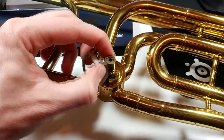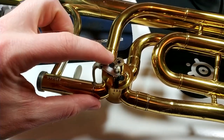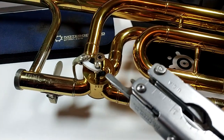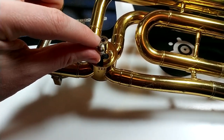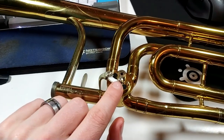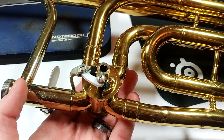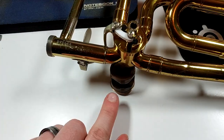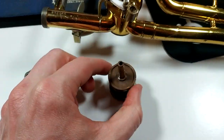Now you're going to want to get the stop arm — which is the part here with the little guy that stops against the bumpers — off of the spindle of the valve, which is inside here. There are a couple of different ways to do this. I usually use the very unsavory way of just prying it up with a screwdriver. There are smarter ways to do it, like using a punch right here that you'll put in and then hammer with a nice soft hammer to make the valve come out the bottom. I'm probably going to pry it, but you should probably do the better way. Don't mess up your valve. Once you get the stop arm off, the valve will come out of the bottom. So now the stop arm is just loose doing its own thing, and the valve is now in its separate components.